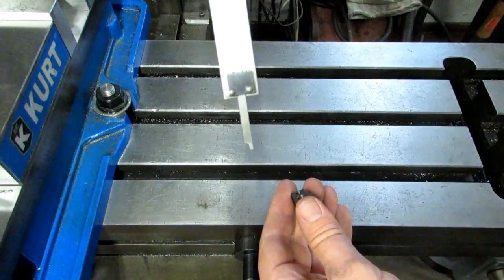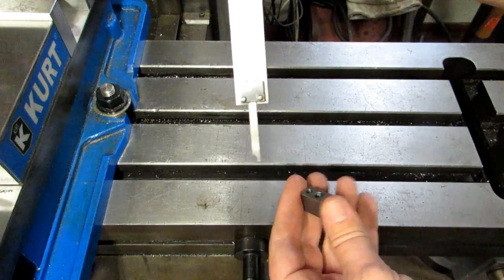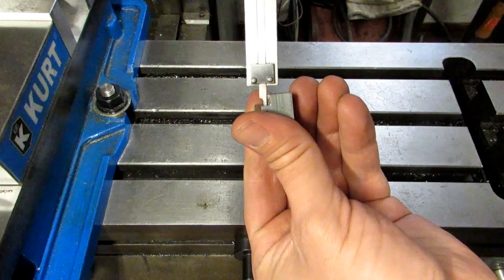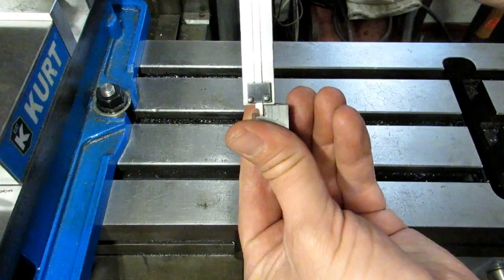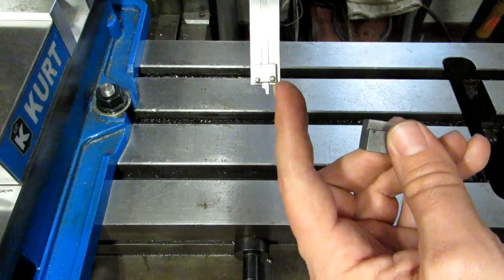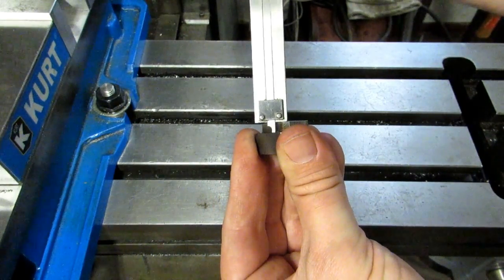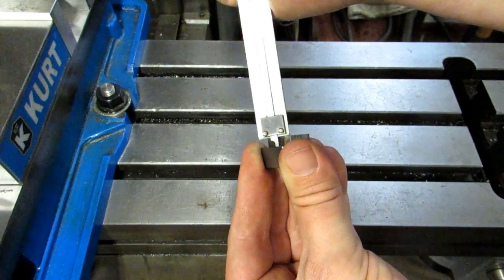You've got this depth rod down at the bottom — that's also pretty obvious. You could use that to measure this little step here, but this is a little bit shaky. It's really good for measuring the depths of holes when you can bridge the gap, but when you're measuring a step it's a little bit treacherous — it wants to lean one way or the other.